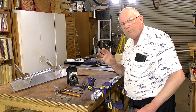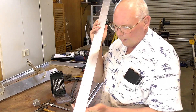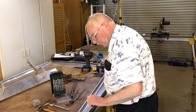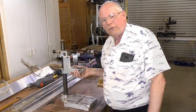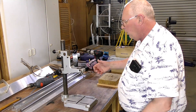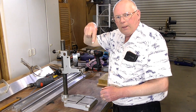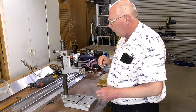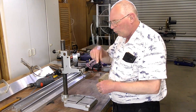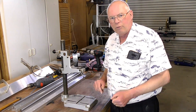I've got another very cheap little tool that will take care of drilling all the way through. All the holes are accurately marked, so I can drill them now all the way through. This is what I use to do most of my drilling on the bench — it's a lot easier than trying to hang on to the drill and press. You need something to give you an accurate hole down through your material. Holding it by hand, you're going to either move slightly and make the hole oversize, or go at a slight angle. This ensures you drill it fairly accurately and square.